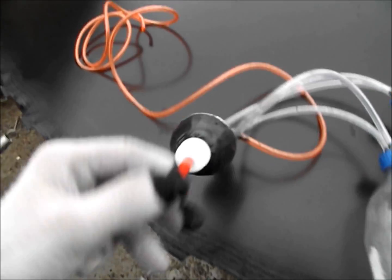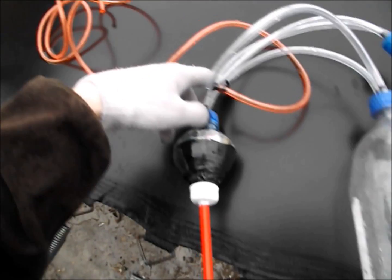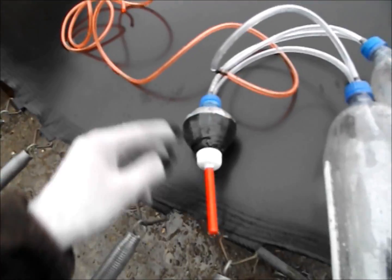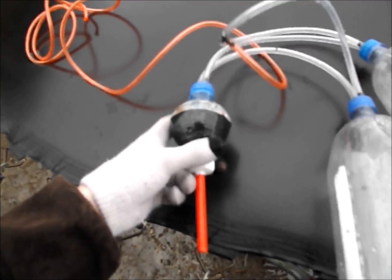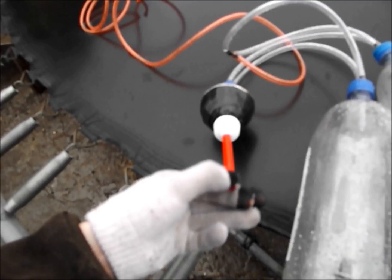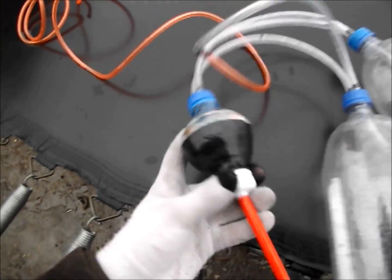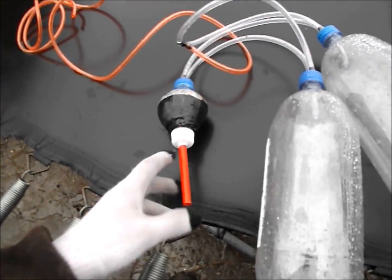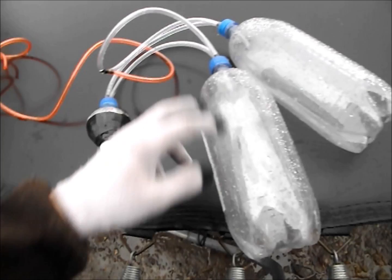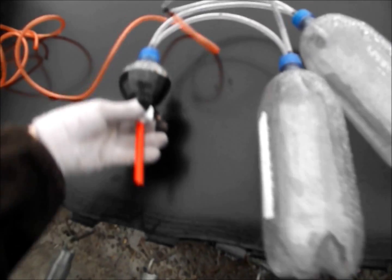You'll notice this nozzle — the outlet is bigger than the inlet. Basically what I'm hoping is that the outlet will be coming out at about the same pressure as what's going in. So if I have 100 psi going in, I should in theory get 100 psi coming out, as long as the reaction performs correctly. And since it's bigger on this ejection side — about 5 times bigger in fact — I should be able to get a net force going that way and get a little bit of thrust. Though with just plain water, I didn't get any thrust.